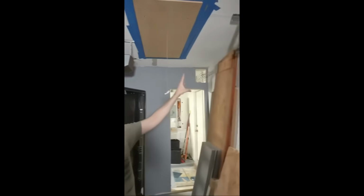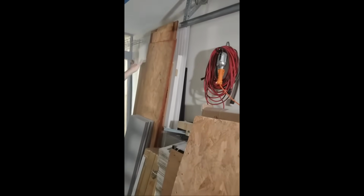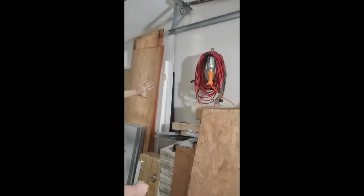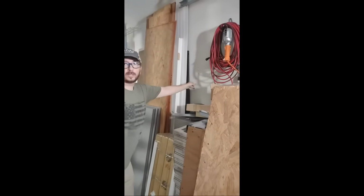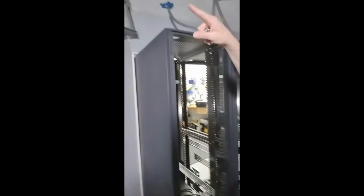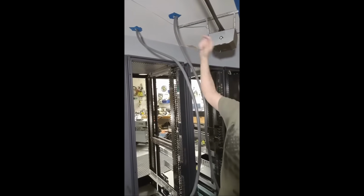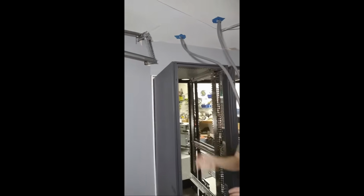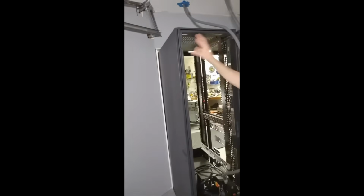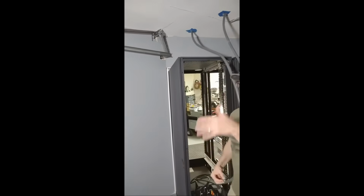These walls have noise deadening insulation in them. So we blew out all of the inside walls and redid that entire area. When we did that, I put in rock wool, and it has really good sound deadening. When we did all of these walls here also, even the header beam up there, all of that has sound deadening. We didn't use the rock wool because you can't get it on demand anymore. You have to order it. But we got Owens Corning's, and it was actually a little bit cheaper, but it has a really good sound deadening ratio. I looked up some of the stats on it.